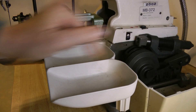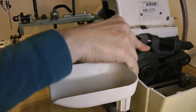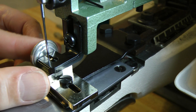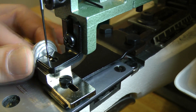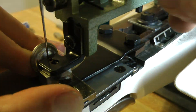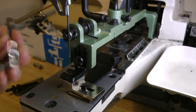On the right is the needle driving wheel — make sure the machine is off. Press the floor pedal to disengage the clutch and move the wheel with your hand to lift and lower the needle. Now you will meticulously adjust the pieces so that the needle goes through the center of the shank hole and stitches over to the side. Use the two bolts on the clamp and the two bolts on the feed plate, and make sure that nothing rubs on or obstructs the needle.